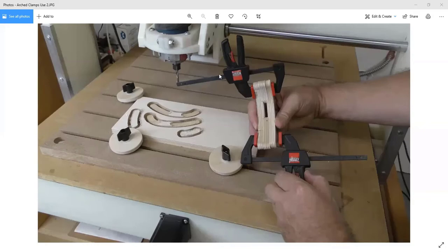So I want to be able to plane this board down, to shave the top of it off very lightly so that it's absolutely parallel in the Z-axis with the travel of the head. That way, when I do the lettering, when I do carving with logos and stuff, it's all exactly accurate. But in order to do that, the head of the machine has to be able to travel across the entire spoil board. So this one is about a 22-inch square working area.